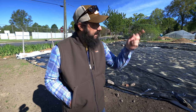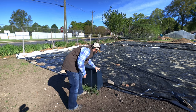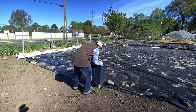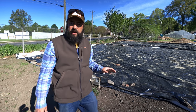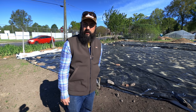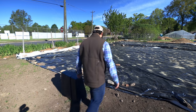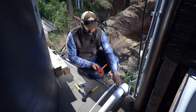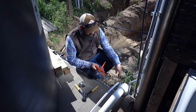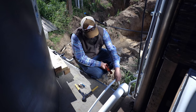The first thing I'm going to do is put a shutoff valve in over there — there really isn't one, which is crazy. This is the backflow preventer for the farm; this is where our city water comes in. I'm just going to shut this off and then we're going to go put in that shutoff valve over at the wash station. This is our main water coming in, so I'm going to put a shutoff valve in here — there isn't one, so I'm just going to cut this connection.